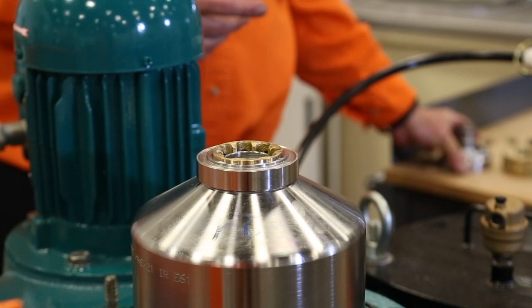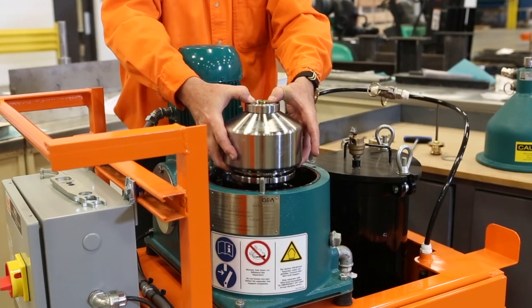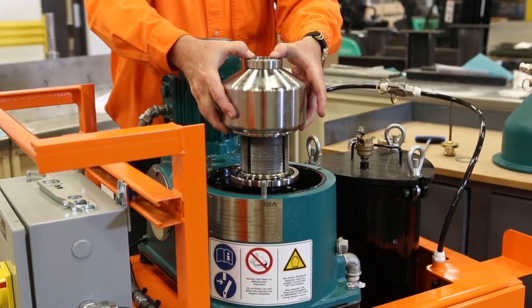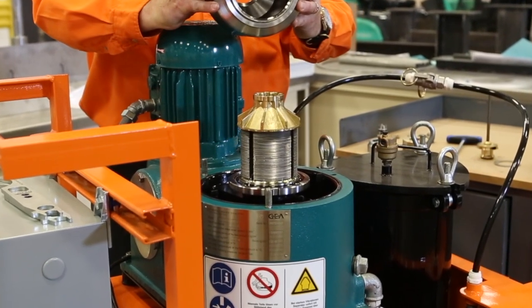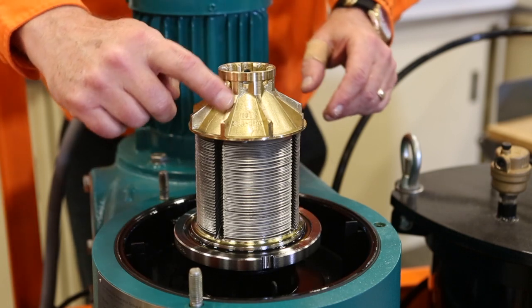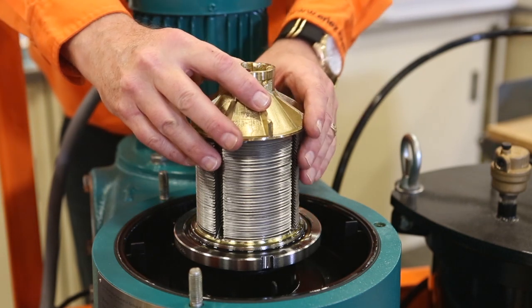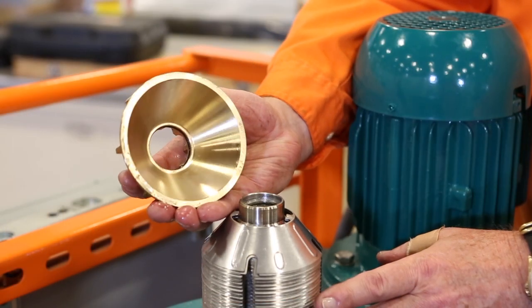Place your thumbs on the brass piece sticking slightly above the bowl top. Reach down with your fingers to the lower part of the bowl top and lift straight up. If the unit has been used, fluid will flow out of the bowl and drain out of the frame. The disc stack is now exposed. On top is the thick separating disc, which keeps dirty fluid below it and allows clean fluid to rise up between the fins to be discharged out of the bowl during operation.